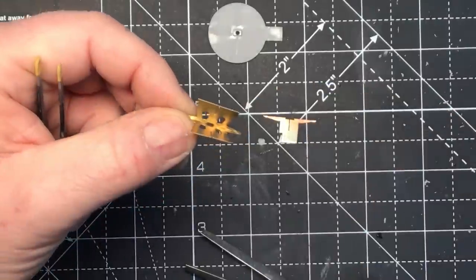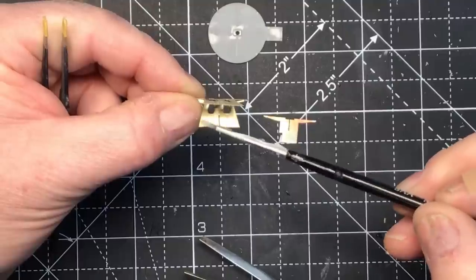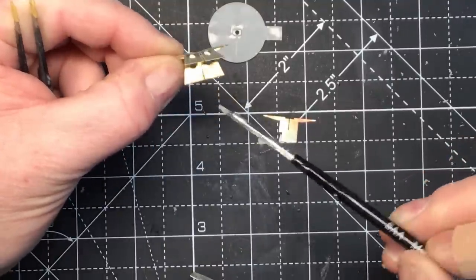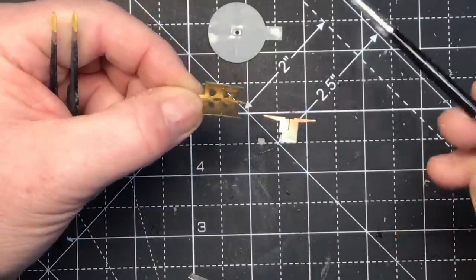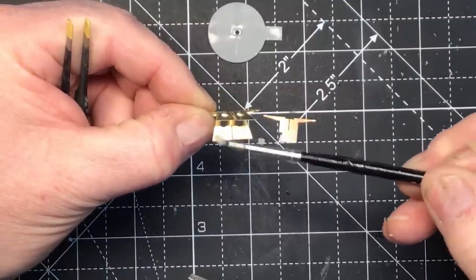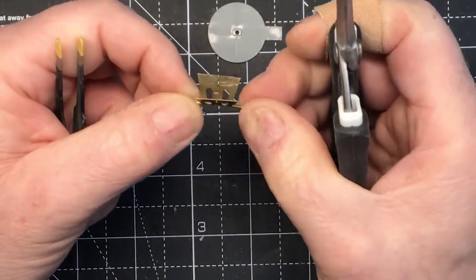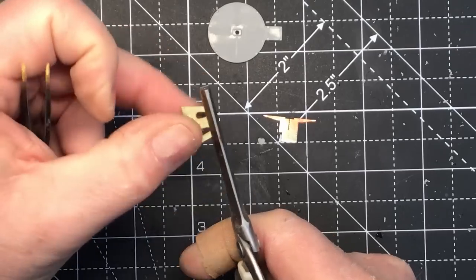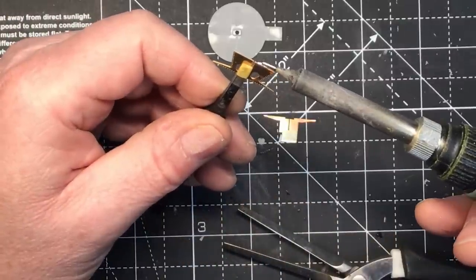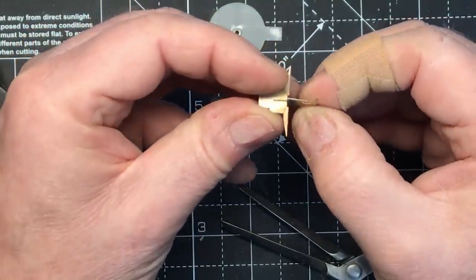Get the fold started and put some flux on the bottom. I need to be careful not to get any flux bridging the slot on the underside, because if the flux fills that gap the solder will flow in and block it — and we need that slot to fix these two parts together. Hopefully the two parts should slot together if we haven't got any solder in the way.